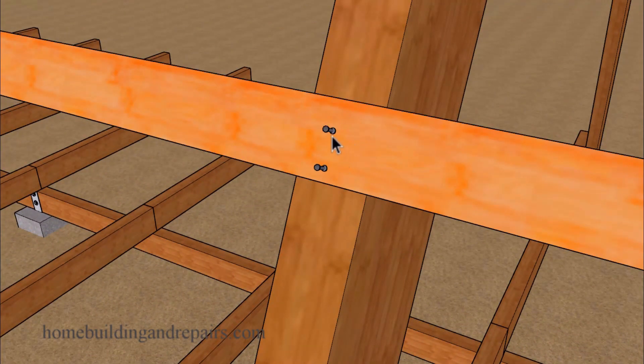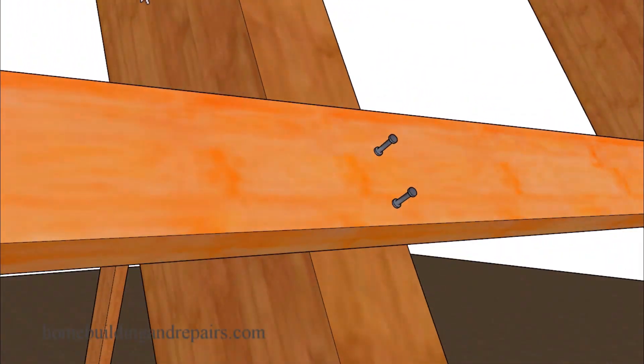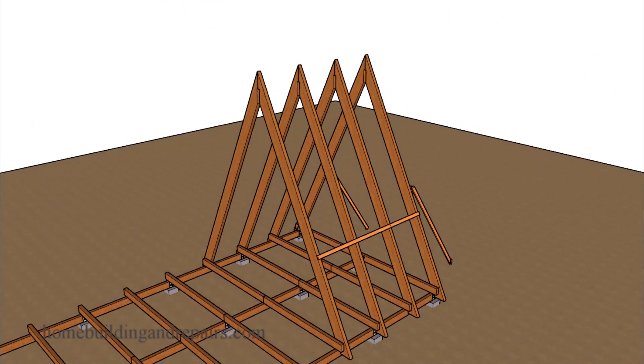We can use nails or screws to position the rafters in the correct location. It wouldn't be a bad idea to grab the rafter and shake it a little to make sure it isn't going to fall down, because you can always install additional bracing. This would be one of those situations where it's better to install additional bracing before continuing on with the assembly if you're not 100% sure it's currently strong enough.